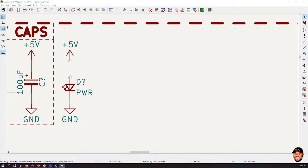So we need a resistor of 300 ohms. Now, you don't choose a resistor only based on its resistance. There are other things you have to consider. Resistors come in different sizes. You can have a 300 ohm that is big, a 300 ohm that is small. The sizes of resistors are associated with their power, which is the ability to dissipate the excess energy they are supposed to handle. In the first session, I talked about power being the work done on the electrons as they are moved through the circuit. So it's voltage times current. Take note, this voltage is not the voltage of the source. It is the voltage dropping across that component, which is 3 volts, and the current flowing is the same 10 milliamps because the components are in series.